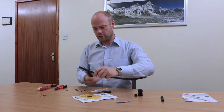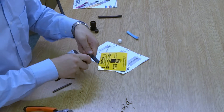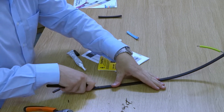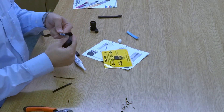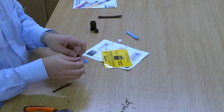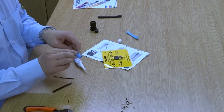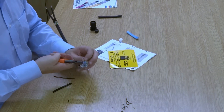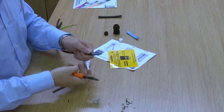We get our cable and we're going to remove roughly around 25mm of the outer sheath in the middle. We cut that and pull it away. We then push our braid and completely cut it off — with your side cutters we cut round and remove the braid.